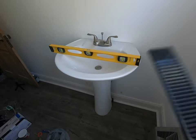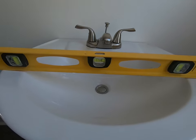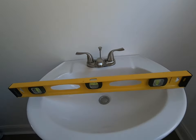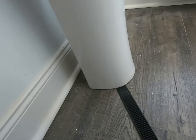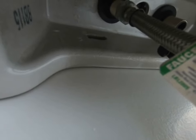Next, you're going to put the sink against the wall. Make sure it's level — which in my case, of course, it isn't. So composite shims are going to be your friend. You don't want to use wood shims because, obviously, if there's water in the area they might deteriorate. So we're going to throw it down here and make sure we're level before we go underneath and mark where I need to drill my holes.